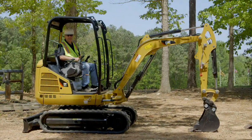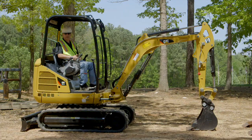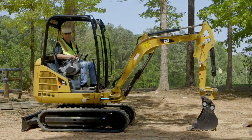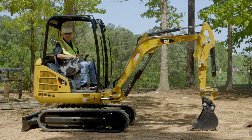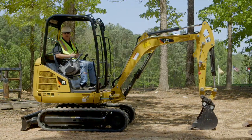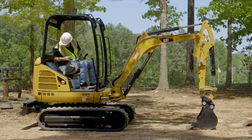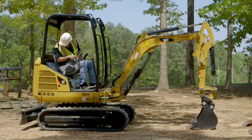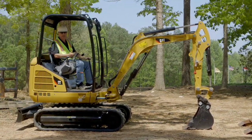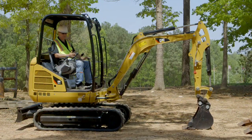Now let's look at blade positioning when it comes to transporting and loading an under 3-ton machine onto a trailer. Like all excavators, there's a lot of counterweight in the back end of the machine. With small machines that are very light and all that counterweight in the back, you've got to balance the machine when loading. Have the blade behind you, not fully in the air, but high enough off the ground to clear what you're loading. If the blade touches the ground as you go to load onto the trailer, you know you need to do something different or you're getting into a rather dangerous position.